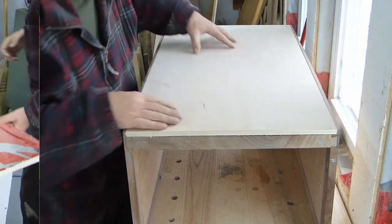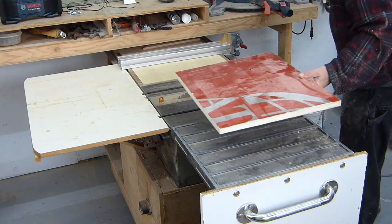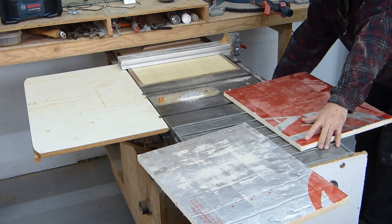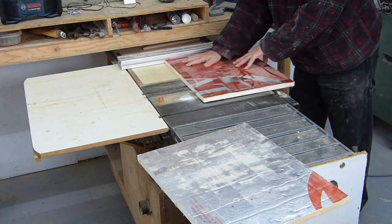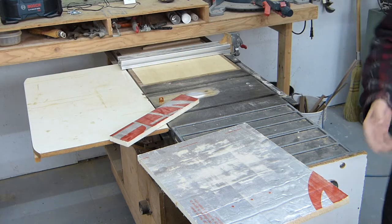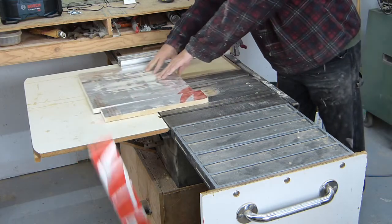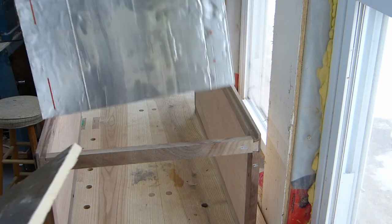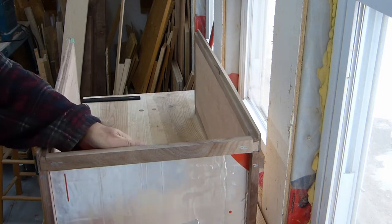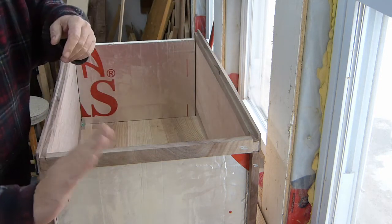And that looks pretty good. What I have here is leftover styrofoam insulation from building, and I'm going to cut that to the inside measurement I just measured. So now when I do my glue-up, if I take these pieces of styrofoam and stick one in here and one at the bottom — because the cut on the table saw is square — they will stop it from racking.